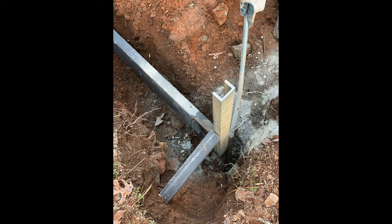Here's showing what it looks like when we're setting up the concrete. We have the concrete in there and water in there. Now I have a piece of metal or wood going up against the dirt just to hold it in place while it cures. And you can see me now using conduit — just a hollow bar of metal — pushing it down in there over and over to get the water to permeate through the concrete. We have a bunch of conduit laying around because we use them as stakes for our trees.